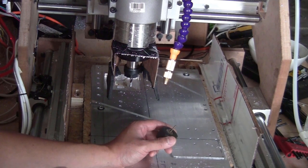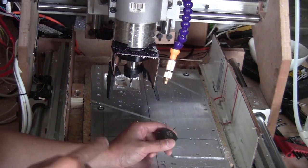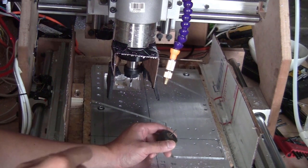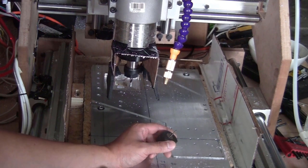To find the center of the hole that I chose in Fusion 360, I would have to use something round and smaller than the diameter of the hole, so I would use the shank of a 2mm drill bit. So let me just tighten this on the spindle and use the hole center finding script to find the center of that hole. I don't want to go into the details of this script because it's not me who wrote it. I just copied it and learned how to use it from a YouTube video. I will give you the link of this video in the description.